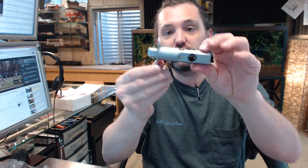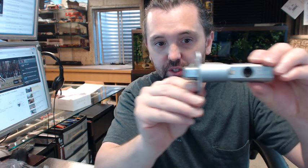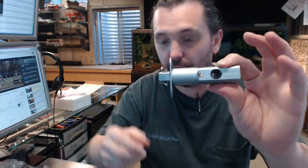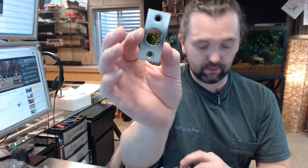You are going to get the latch inserted into the door where it has to go. You are on the exterior and the door is going to slide this way. This threaded post needs to be on the inside — in that event there is only one side it can go in, so it has to go in this way. If I am on the inside, you on the outside are seeing the non-threaded side of the privacy post. Get that in and you're going to come in with your decorative face plate, which is stainless steel as well. You will have two screws for installing that, and there are two of these — even the screws are stainless.